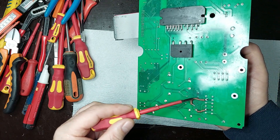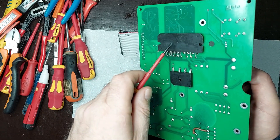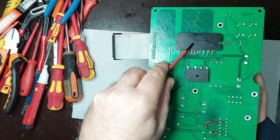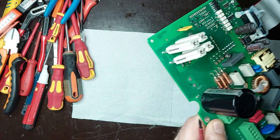These include the short-circuiting of the filtering capacitor, damage to the IGBT transistor module, an individual IGBT transistor, and multiple integrated circuits. All these damaged components will be analyzed and presented in detail in the following steps.